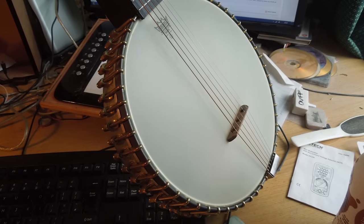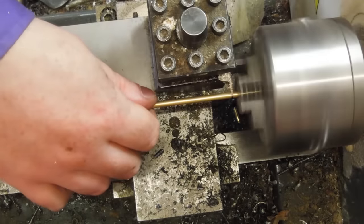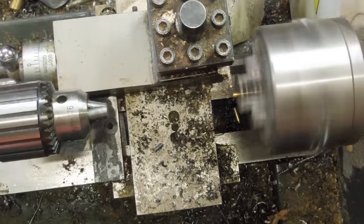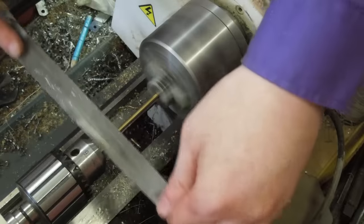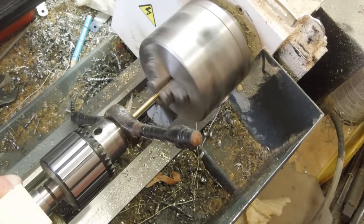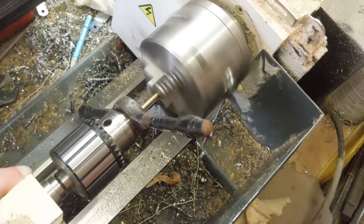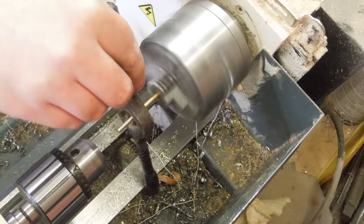In the past I made 50 hooks and nuts for a ridiculous 12 inch rim which only came with the shoes — so with so many to make I'd put a lot of thought into how to best do them, and I'm more or less doing the exact same thing this time. I started by parting off sections of 4mm brass rod with the bar extended to touch the tailstock each time. The bars are then partially threaded using the tailstock chuck to push the die forwards and keep it flat with a small slug held in the chuck. When the threads reach the right length the bar hits the slug and the die starts moving forwards from the face of the chuck, at which point the lathe is reversed to get the die off.